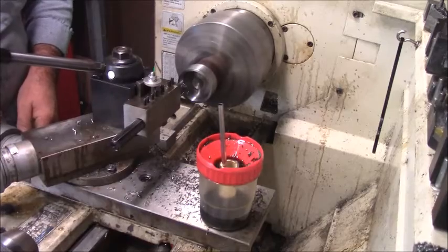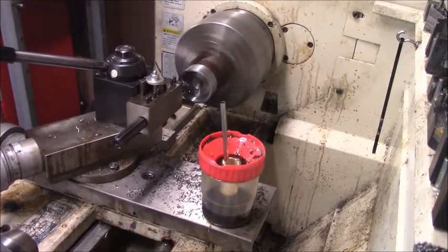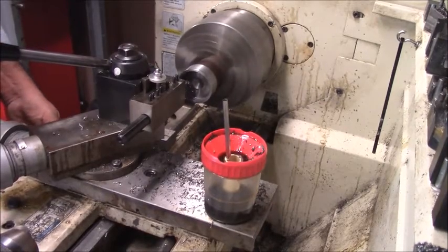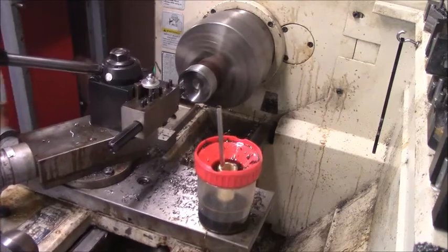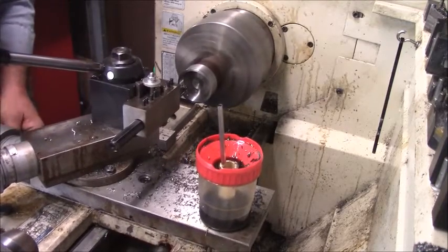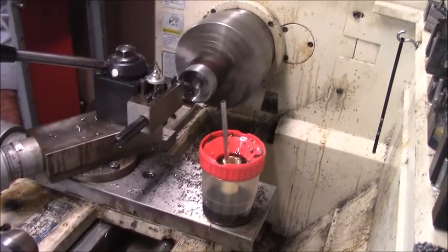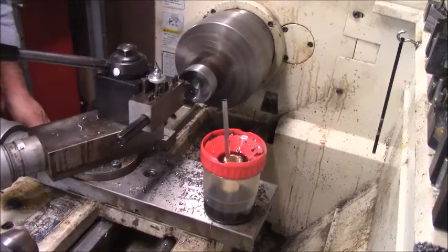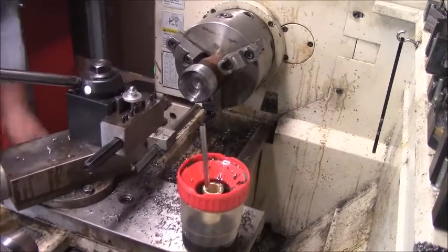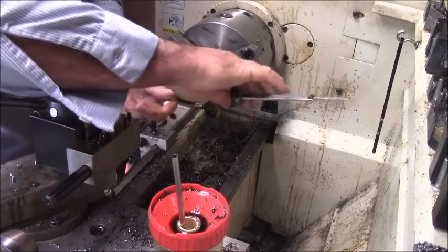So, if I miss it by 5 or 10 thou, I'm not really hurting, because all I'm wanting is like a ring close. You want it close. Now I'm doing the biggest diameter actually. All right. I mean, this is something heat doesn't affect. So I'm really basically looking for around 2 inches, 100 thousandths.